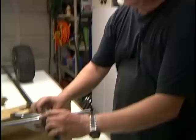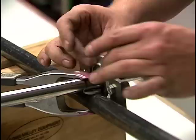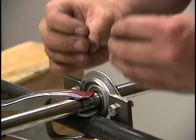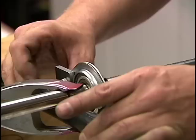And the neat thing about these bearings is there's a bearing holder, then there's the actual bearings, and there can be some offset. This doesn't have to be perfectly 90 degrees. These bearings self-align once you begin to tighten these down. So that's a really handy thing to have in a frame that is essentially a parallelogram and not a rectangle.